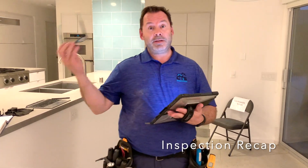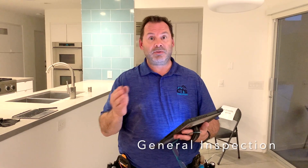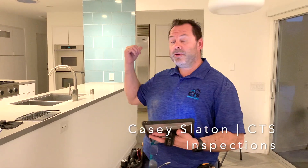Inside the main electrical panel — and you have two electrical panels, a main and a sub — there's a breaker that was tripped when we got here and it does not reset; it constantly trips. There may be a short associated with that circuit. It's a 15-amp breaker in the main panel on the east side of the garage, and that should be identified in the pictures.